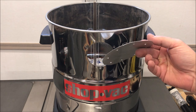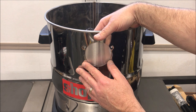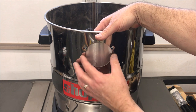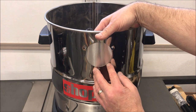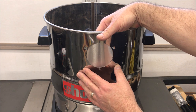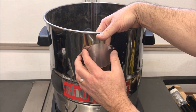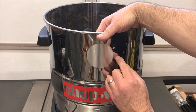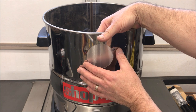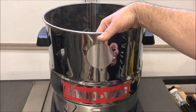With the patch drilled out, you can see it has a really nice contour that fits the can. I'm going to put this on the floor for the next step because it'll be a little easier to work with. I'll eyeball the center mark and make sure it looks roughly centered over the hole. From the inside of the can we'll drill one hole through the can, apply a pop rivet, then adjust the patch to make sure we have a nice area around the inside of the hole for the remaining rivets — making sure none of them sit right on the edge of the patch.